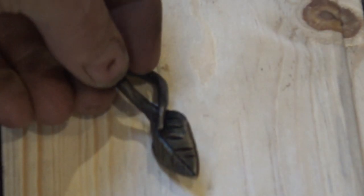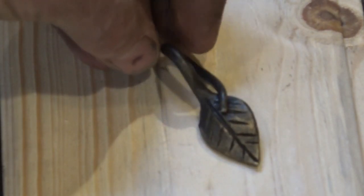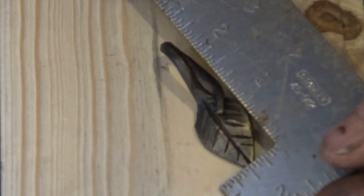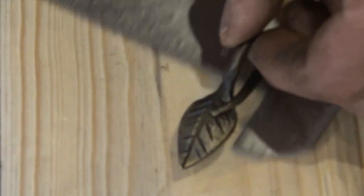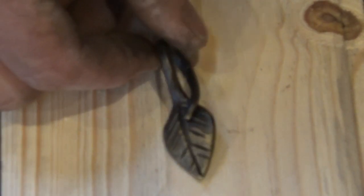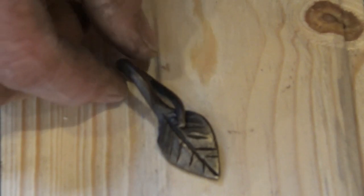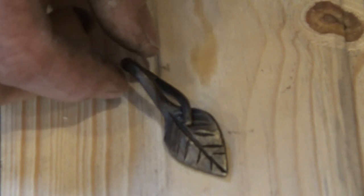This is our little leaf that we're going to make today. It's really quite small and delicate. It's made out of a piece of 3/8 square bar. The whole thing is only about 2½ inches long. The leaf itself is about an inch and a quarter, and it looks like it's about 3/4 inch wide. Those dimensions really mean very little — make the leaf the way you want it. You can make it bigger, smaller, thicker, thinner. I think this is a very good size for quite a few uses, and it's a good start in making leaves.